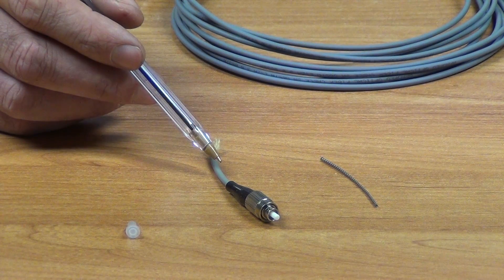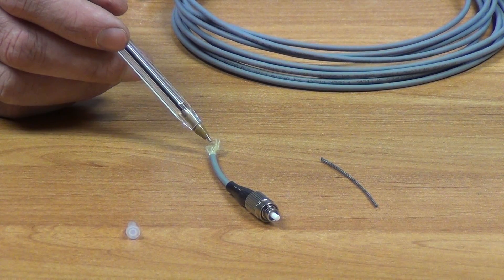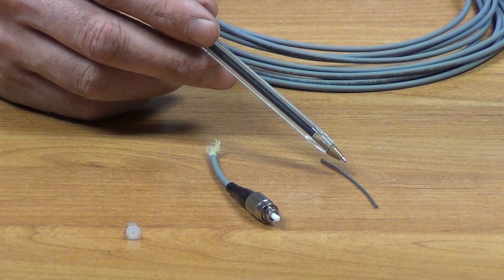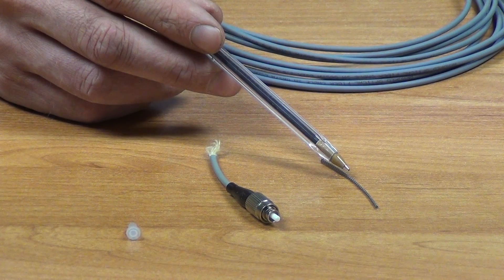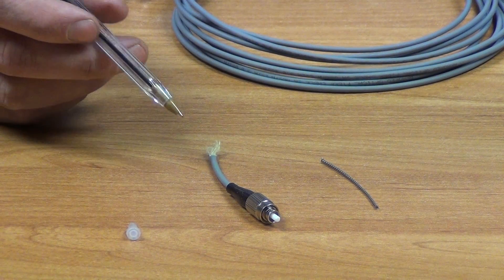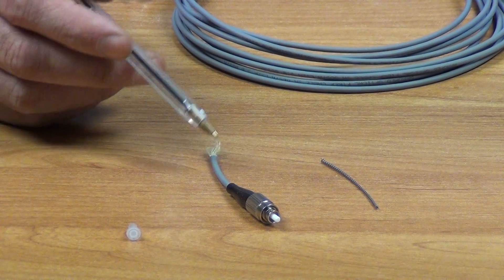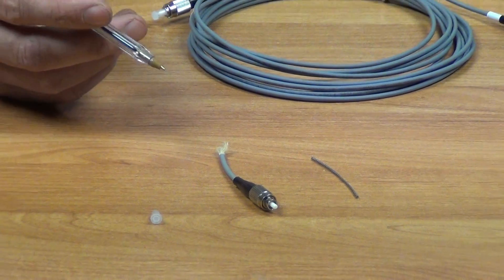Although the outer diameter of the cable is three millimeters, inside we have layers of fabric braiding, and then inside again we have the steel armor, which gives the cable such strength and rigidity. The actual fiber optic cable in the center is only about 0.2 to 0.25 millimeters — the outer cable is roughly ten times as wide.